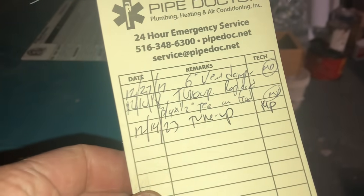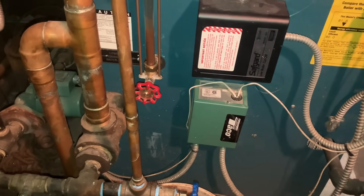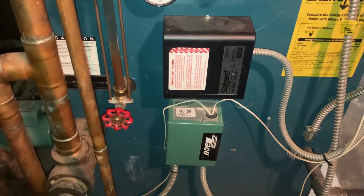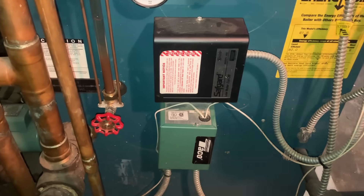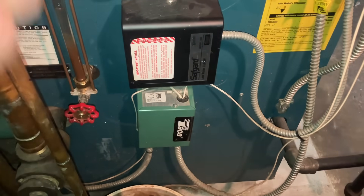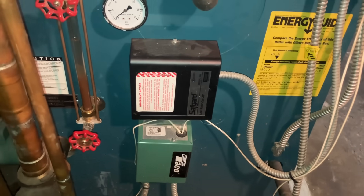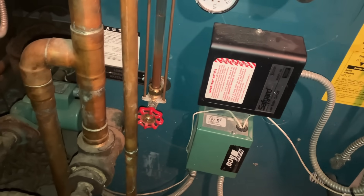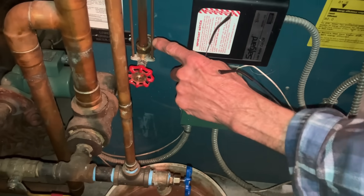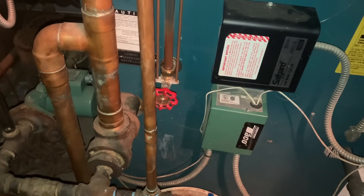This is the steam thermostat. The strange thing about it — it runs out of water. It's not the automatic fill. I never read this before — it's some kind of warning label and it actually says remove the label. It tells you that if you add an automatic water feeder, to use the Hydrolevel low-water automatic water feeder, because that one has the built-in clock or water meter for gallons. We've had this for a long time. It's a great boiler.